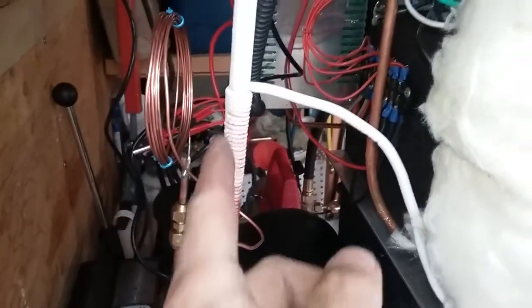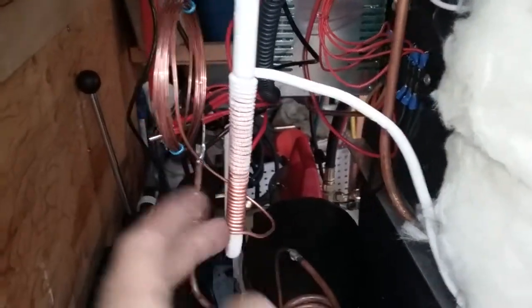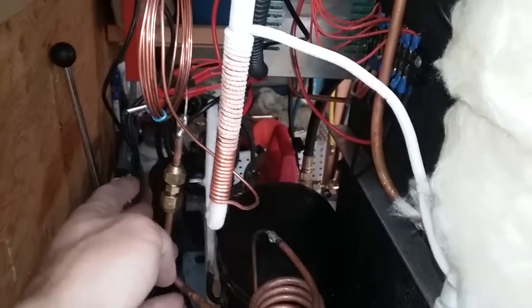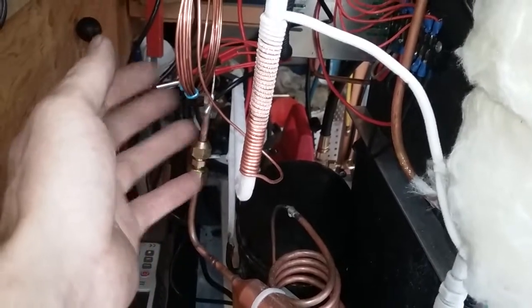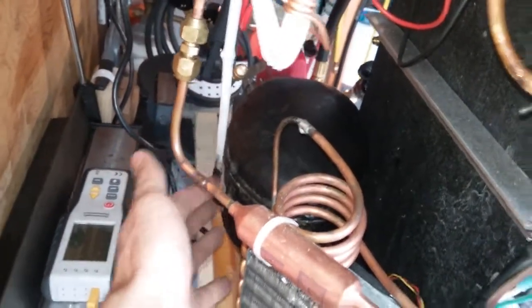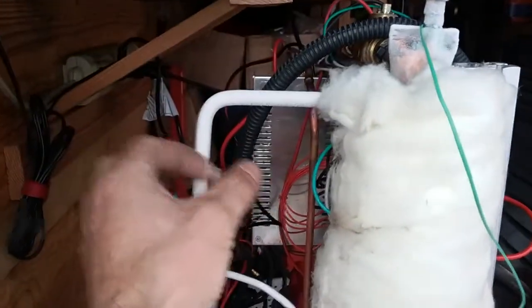You can see I have a heat interchanger here on the suction line. That's pretty important, especially for something small like this, where there's not a lot of heat load on this thing often. So, we wrapped the cap tube around there. Probably could take this flare out now that I know the cap tube length is fine. I could have brazed it right into the discharge line after the filter dryer and the condenser. When I do that, I'm going to go ahead and finish wrapping the majority of it around the suction line — prevents it from frosting the whole way back to the compressor. For this charge, it seems like it can run all day. There was frost like that big around a quarter-inch suction line.